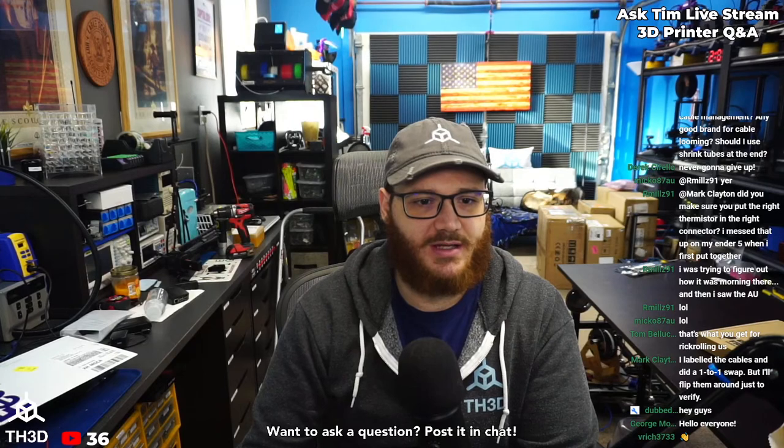All right, Mark. Mark is going to kick off our question today, and he says, "Hey Tim, just purchased a new Creality 427 board for my stock Ender 3. Swapped it out super easy. Now, when attempting to print a test cube, the thermal runaway kicks in and shuts down." Now, did you check to make sure that your hot end and bed are heating up? Like, if you just tell it to heat, is it getting up to temperature normally, and is it staying at that temperature?